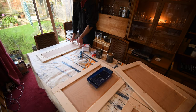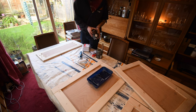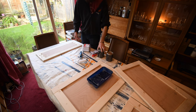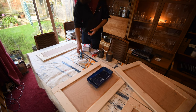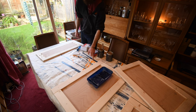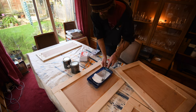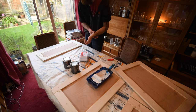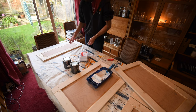They're all dried and it's time to get them painted. I'm going to do two coats of all-purpose undercoat in white and then use the blue — Payne's Grey — in eggshell for the actual finish on the cupboard. The blue looks quite good with the rest of the van. I've got the Moroccan Sands orange alongside the Payne's Grey blue — it's a nice dark and light combination. I'm going to paint the backsides first, then use spare M10 nuts to prop the door up so the entire back panel doesn't stick to the tablecloth.